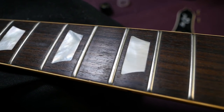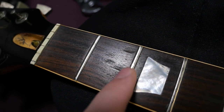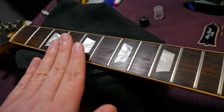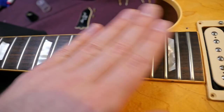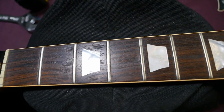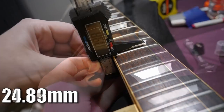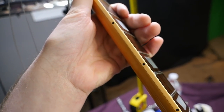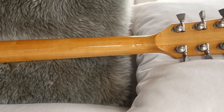Despite the top being relatively clean, this guitar was played a lot. There's some fingernail divoting, and considerable fret wear especially on the 2nd through 6th frets — so maybe a heavy rhythm or solo player in that territory. I'd put this on the list of 'probably needs a level and recrown,' but I won't fill those in as they don't really affect play. Nut width is 1.67 inches — kind of skinny. By the 12th fret it gets really wide at 2.06 inches. First fret neck depth is 0.81, and 0.98 by the 12th. It's a C-shaped neck — wide, relatively thin, with a little bump to it.